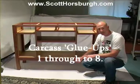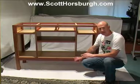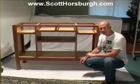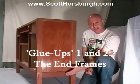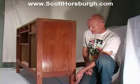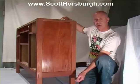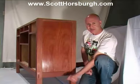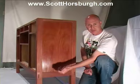Here is the carcass completely glued up and ready to be flushed. This carcass was glued up in 8 separate stages. Glue ups 1 and 2 were the 2 end frames. This is one of the end frames. It's a very basic frame and panel construction. Everything is mortise and tenoned, except for this top, front and back rail, which I'm using dominoes for. The panel has a tongue and the frame has a groove. So it's a standard frame and panel with tongue and grooved joinery.